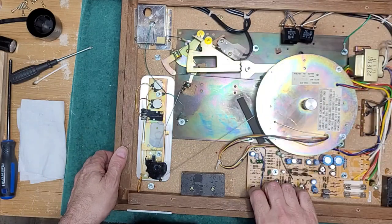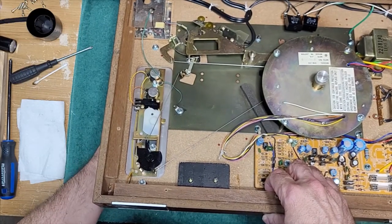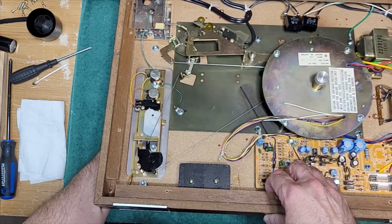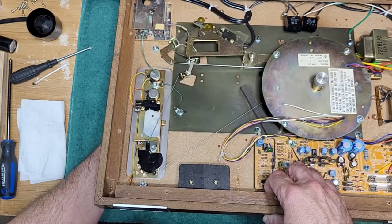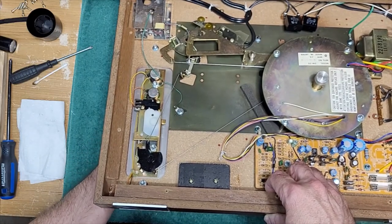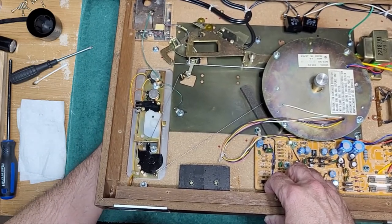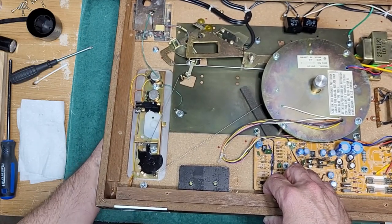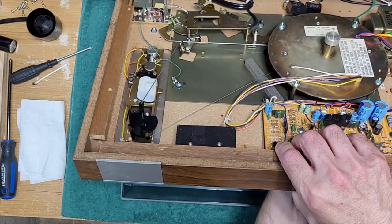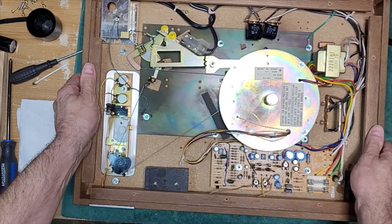So it's supposed to be zero residue. It's supposed to clean electrical components and leave no residue whatsoever. And it's also safe for plastics. So I think there's carbon trace potentiometers that can be damaged sometimes with DeoxIT. This stuff should be safe to use on those. And I can feel it's doing a great job at cleaning up these switches. I'm just moving them back and forth. Very nice. All right. I'm gonna call those done.